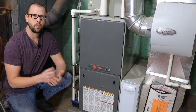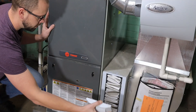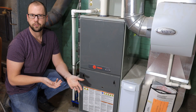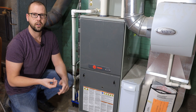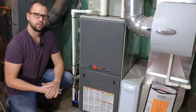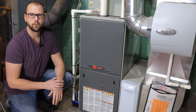Some reasons you might want to change your blower speed is if you replaced your filter. Say you've got a whole home air cleaner like this, and you wanted to install a better filter like a MERV-16 instead of a MERV-13, which is going to filter a lot more out, but it's going to also be a lot more restrictive, so you kind of have to compensate for that somehow if the system wasn't originally designed for that filter.